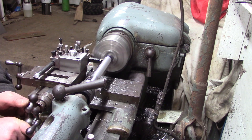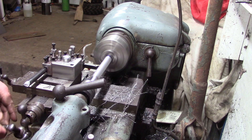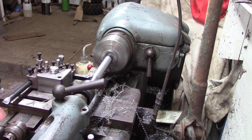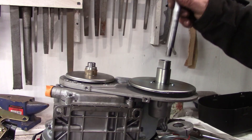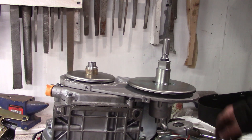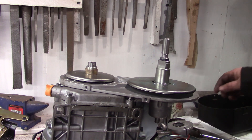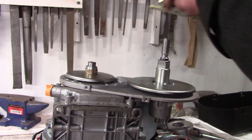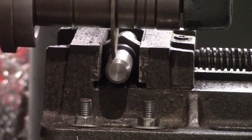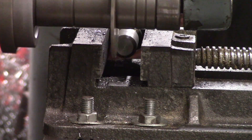We're making a brand new shaft. There's the new shaft roughed out - got a few features: threaded on the end to take a nut, a keyway, and most importantly the splines so it mates up with the gearbox. And here we are cutting the splines on the new shaft. I'm just using nuts instead of a collet block again - they work quite nicely on the axle.